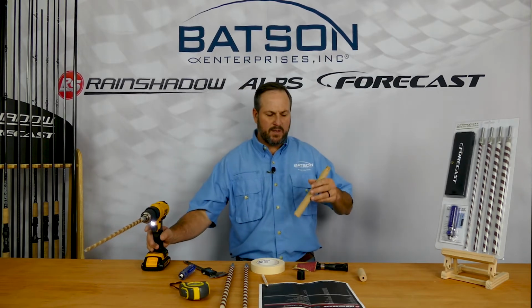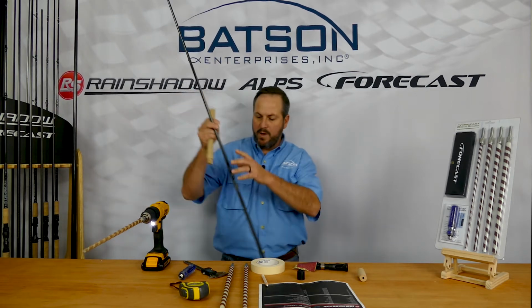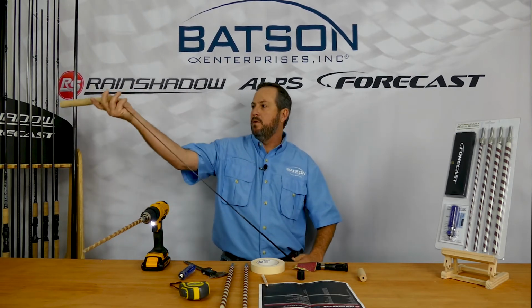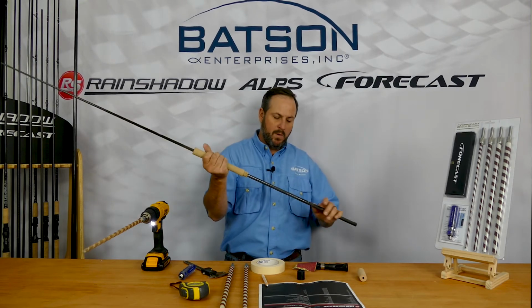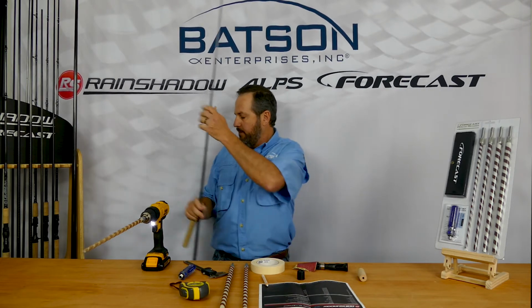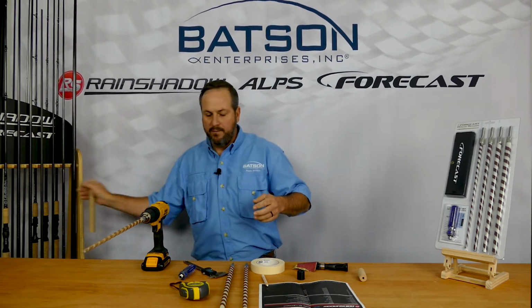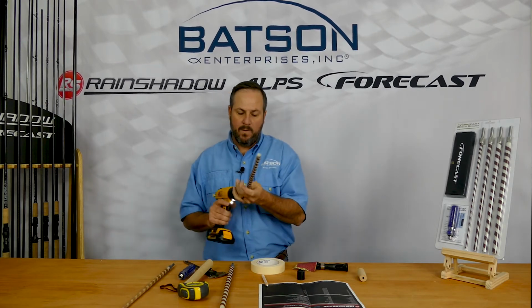When you're dry fitting, it's always good to check it on your first reamer. Even though you know what your measurements are, you're going to be safe and not over ream. If you do over ream, it's not that big of a deal. You can always tape arbor if you have to, but you don't want to be doing that every time. So making sure you got it right, we're going to go ahead and switch to the large.